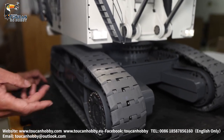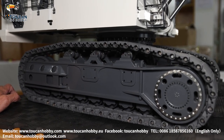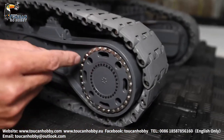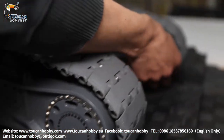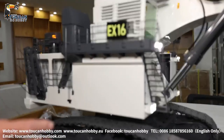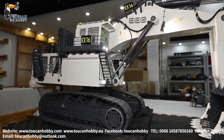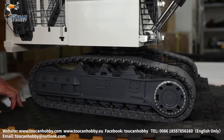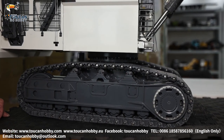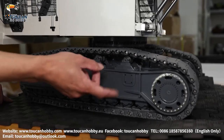Inside we have a sensor brushless motor with 128 ESC. This is the driving wheel inside, and here we have two motors. This machine is very heavy, around 135 kg. It uses screw reduction combined with planetary deceleration, so the motor high speed is reduced to high torque slow speed.